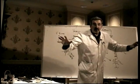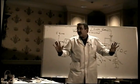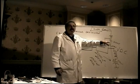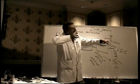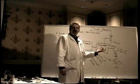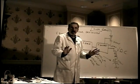Never, ever, ever replace, in my opinion, never replace a vertical output integrated circuit without replacing the charge pump or boost up capacitor or whatever it's called. It is 15 cents, cheap insurance, baby. Don't test it at all. Don't worry about it. It's 15 cents. Take the thing out, throw it away, stick in a new one, put in the new vertical output chip, and you're done. Make sense? Okay?